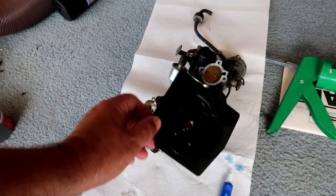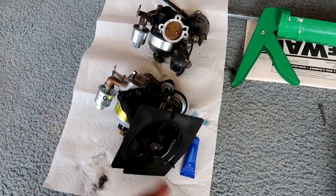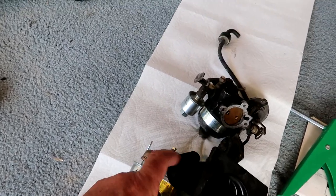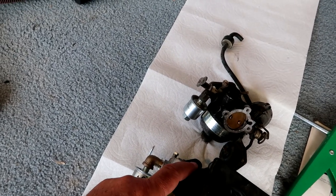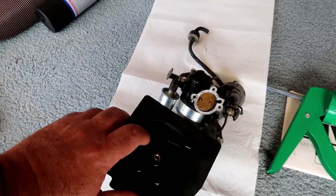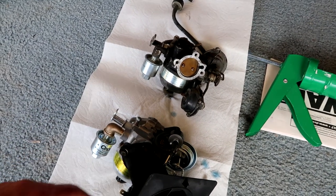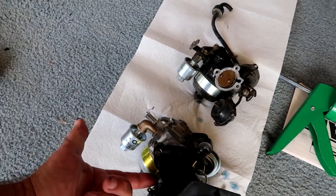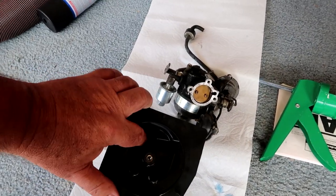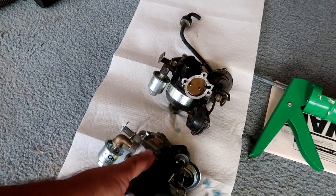This right here is the part where the air filter will go — it's a box about so big. To get this off, it has two bolts on the outside, but the third one is actually located inside. So if you're ever trying to remove this piece, just remember there's no bolt on this side — it's actually located inside. That kind of tricked us for a while until we found that out. Now we're ready to put this in and attach it to the generator.